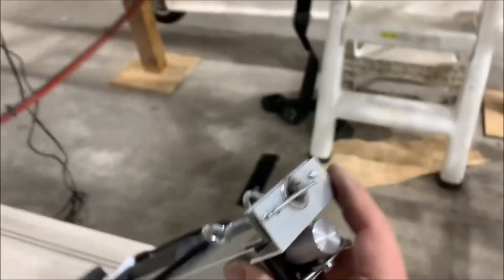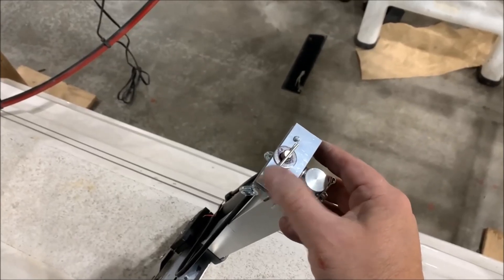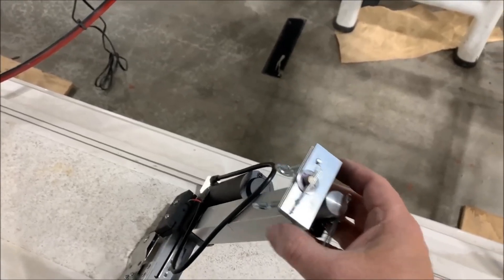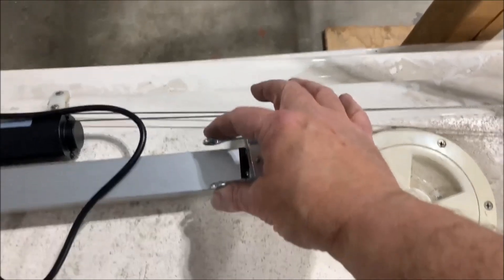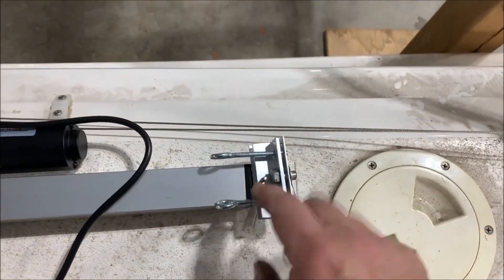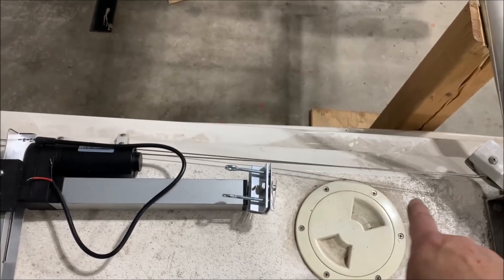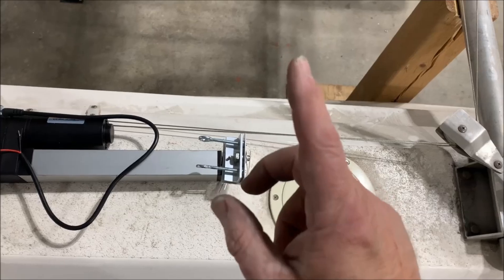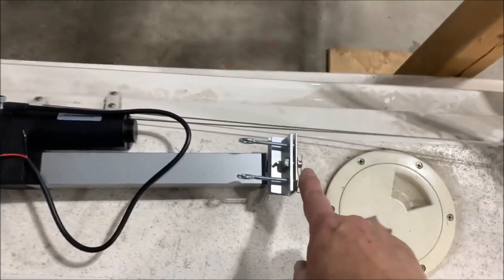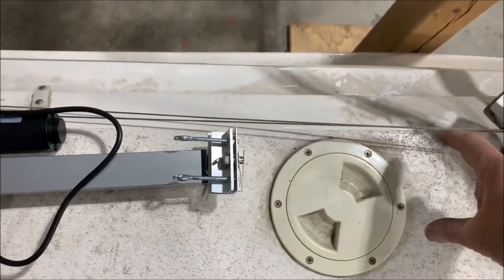It's not finished at all. This is the part that moves forward and back. Over here there's just a cotter pin, but there will be a spring pin that can be pulled out. When that pulls out, the bracket will separate. This is where the cables for the main landing gear will tie in. The nose gear ties in on the screw over here, and if I pull that pin it will release. That's just in case this is extended and I can't retract the linear actuator — meaning lowering the landing gear — which would be a very bad thing. So there's going to be a cable tied to that spring-loaded pin and a red handle to yank on it, and that separates, and gravity will drop it down. Gravity is what drops these landing gears anyway.